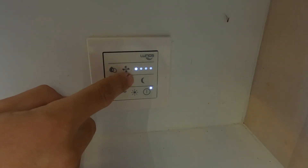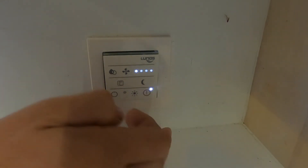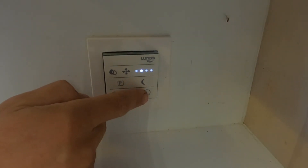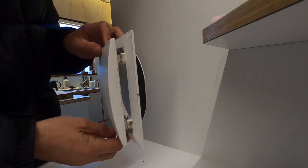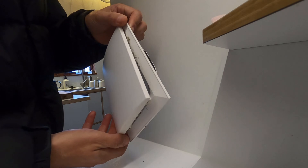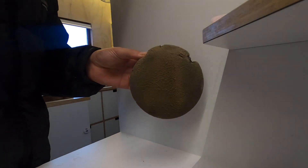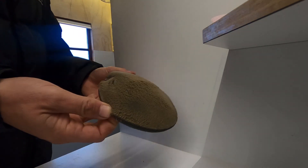Number six: event button. When this LED lights up, the filters will need to be cleaned in soapy water. When it's done, press and hold. We've had this unit for two, maybe three years, and I've been really bad and haven't even thought about cleaning the filters until now. That's the cover — it just pulls off, and you can see it's reasonably dirty in there. That definitely needs a clean. We're semi-rural so the air is reasonably clean, but look at the state of that filter. It probably could be worse, but that definitely needs cleaning — it won't be helping our system.